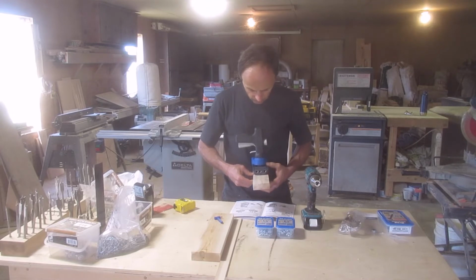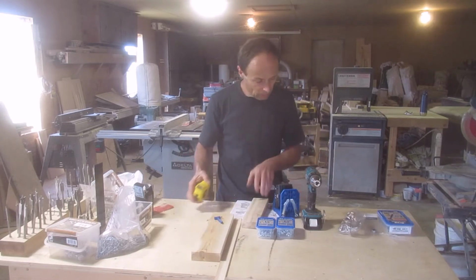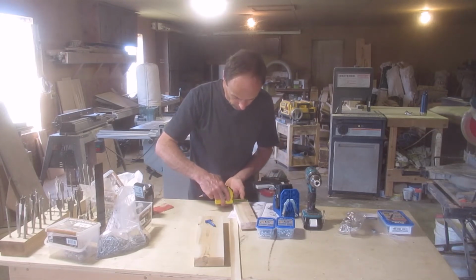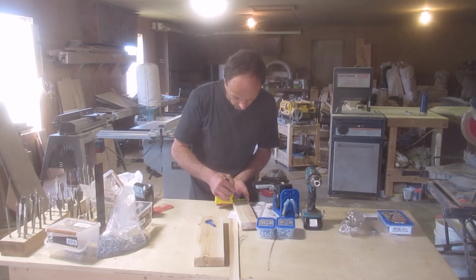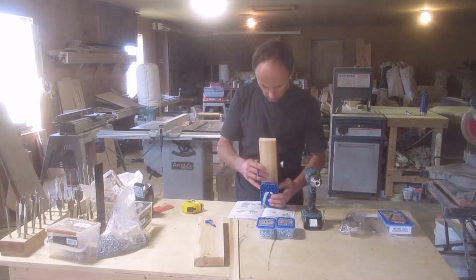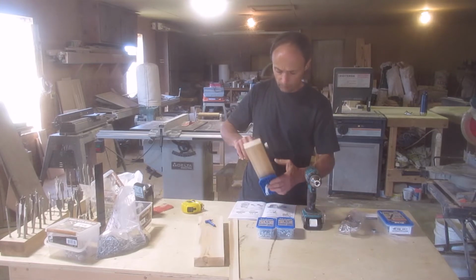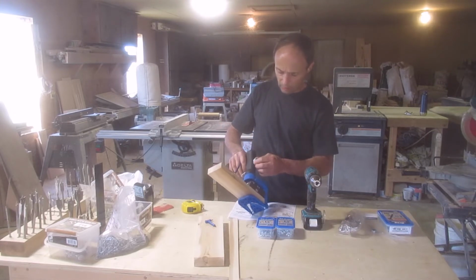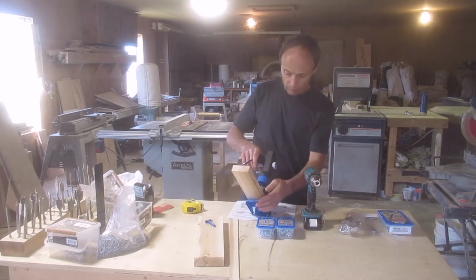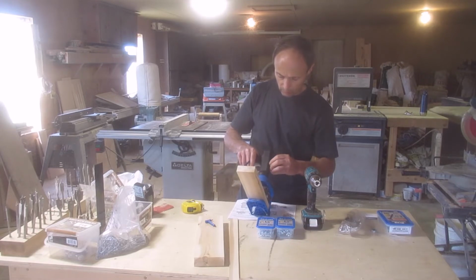I would try to center this in my piece, which I use a center mark over here. I can actually take my work piece to be more precise, and go here and say, okay, 2 3/4. What's half of 2 3/4? It's 1 3/8. Okay, so I'll go here and line that up with my center mark and just clamp down on it. Okay, and I can lock this up, and now when I release my trigger, it's going to release the workpiece. Or it's supposed to release my workpiece.